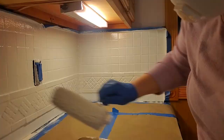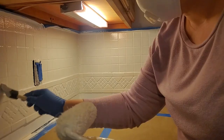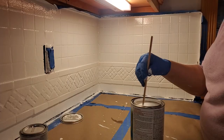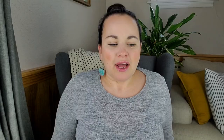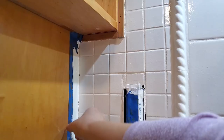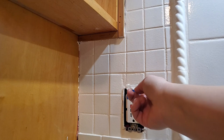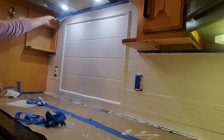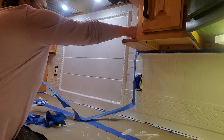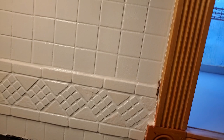The biggest thing I recommend for that second coat is to really pay attention to when you started — you're supposed to peel the tape off an hour after you start painting your last coat. About two-thirds of the way through that second coat, I ran out of epoxy, and it was taking longer to make it stretch, plus it takes some time to mix the second kit. I hate painter's tape. I tried to peel it up as soon as I could, and still there were areas where it kind of pulled the epoxy away. The epoxy formed a layer kind of like really thick nail polish that you can peel off — it was like that where it was peeling up.